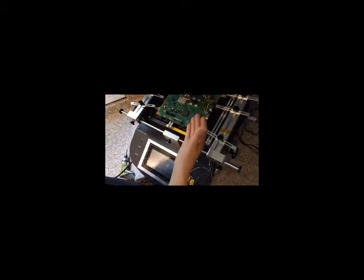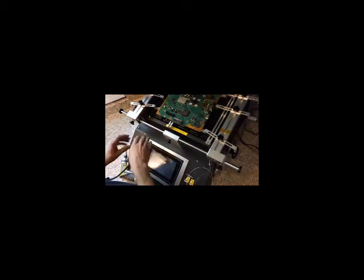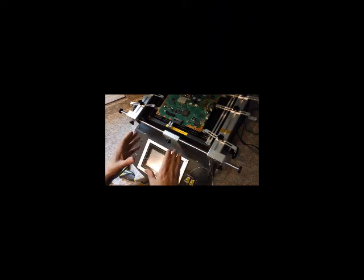And we're going to graph that temperature along with the bottom heat temperature, and then our top model will have a digital readout over on the left hand side, which actually comes under the board and actually touches the board. So we have board temperature, lower hot air temperature, and the actual chip temperature itself. The reason these are the primary concerns here is because your lower board temperature is going to be your highest setting. You're going to want the most heat on your lower part of the board, and that allows our chip to be reflowed from the top with very little abuse to the chip.